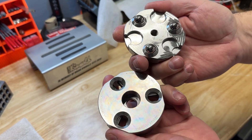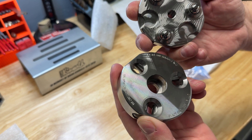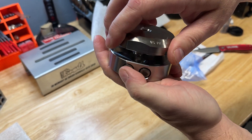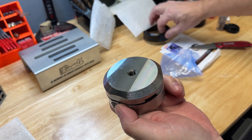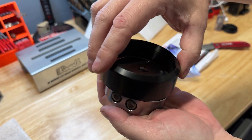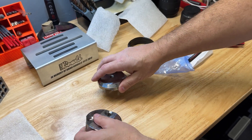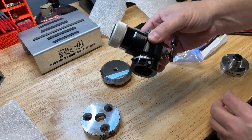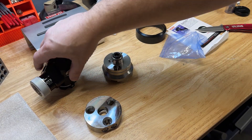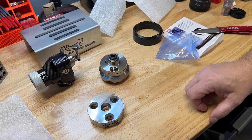Apparently this is the way laboratories mount different pieces of optical equipment, like lasers and things like that. You have these kind of double-point slots — minimal contact on each ball bearing, two points per ball bearing — so it's incredibly repeatable. Since you're going to have magnets on the top side to hold the whole operation together, you buy this chip guard sold separately made from Delrin, and it protects you from getting chips into the system. So now all I have to do is take a few minutes, get this base mounted here, get it installed on the table, and we're off and running.